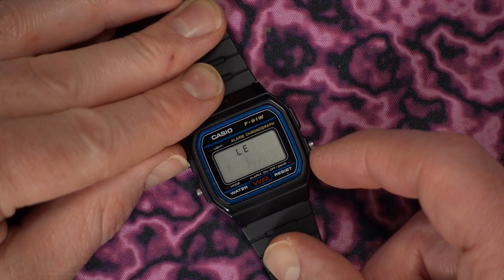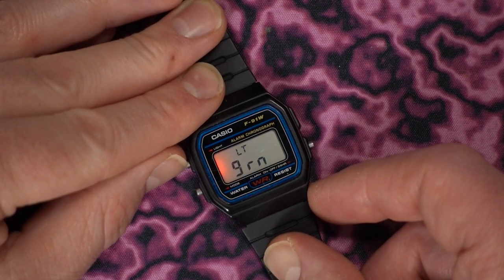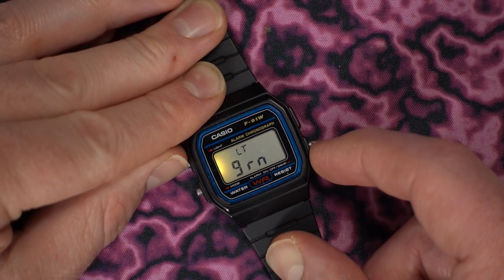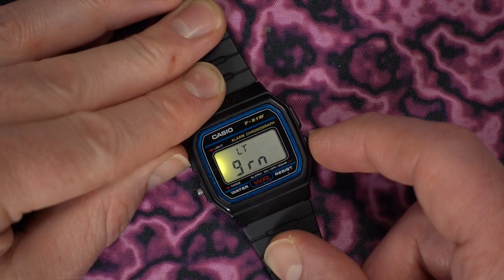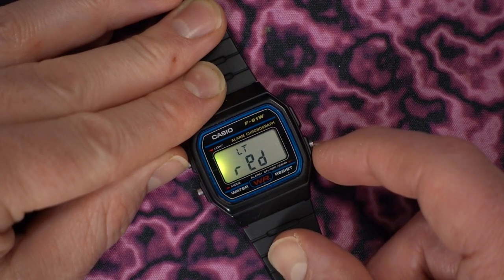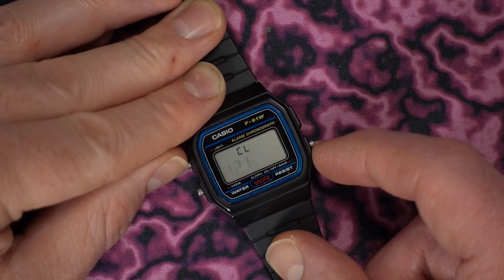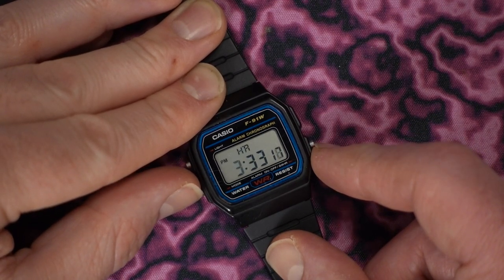There is one feature of this firmware that I think is really fun. Remember how we noticed the PCB had both a red and green LED? Well those are the backlight for the watch, and you can actually change the intensity of each LED individually. So by adjusting the intensity of the red or green LED you can change the color of your backlight. I've seen a lot of modifications where people change the backlight LED or put a colored gel in the crystal to change the color of the LCD — I think they do it to preserve night vision. But the Sensor Watch makes that a user-configurable setting changeable from the watch itself. At night when you press the backlight button you can have any color you want from red to green and in between.